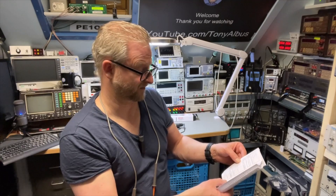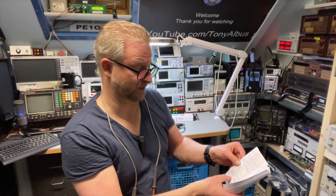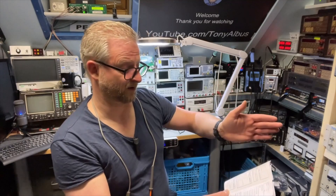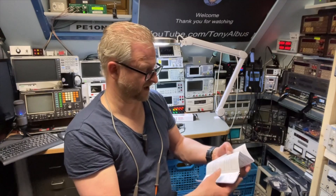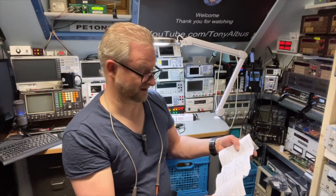It has 6000 counts, DC volts up to 600V, CAT3 600V rating also for AC, resistance test up to 40 megaohms, continuity test that stops beeping above 50 ohms, and even a capacitor test — I have never seen that on a pen multimeter before. There's also a frequency test, going from 1 Hz up to 4 megahertz. Wow.